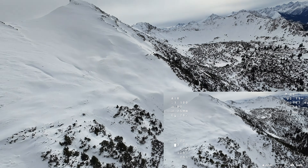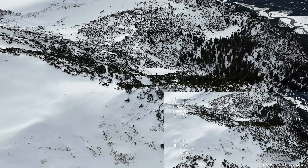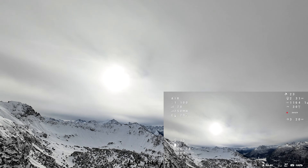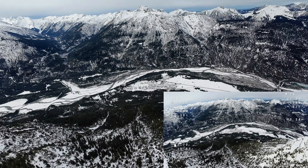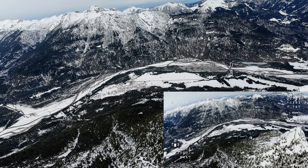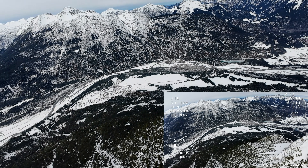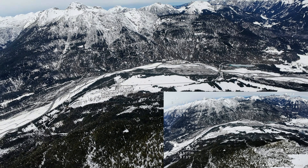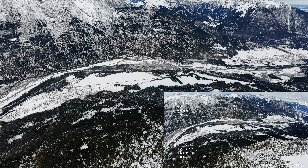During the flight I lost orientation and ended up in my first GPS rescue situation with this drone — so we can immediately check that test off the list. It's good to know that GPS rescue works exactly as configured and that the failsafe procedure does its job properly. Apart from this complete loss-of-connection scenario, both the VTX and receiver links are extremely solid. The antenna setup provided by Proto FPV is outstanding.